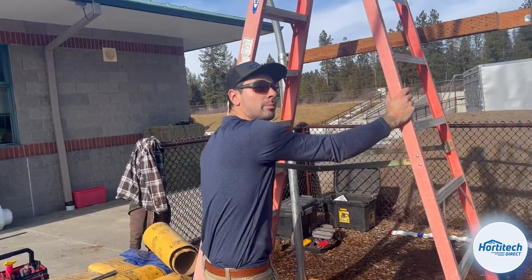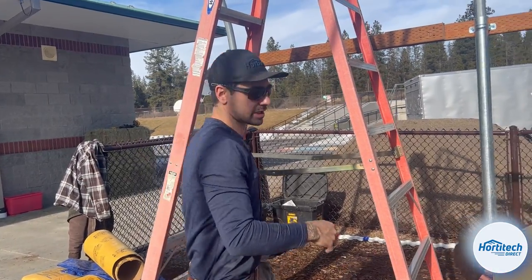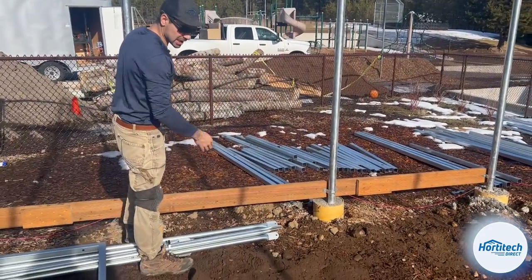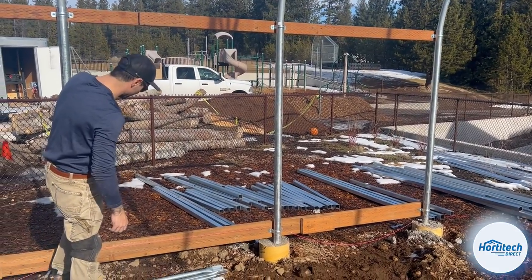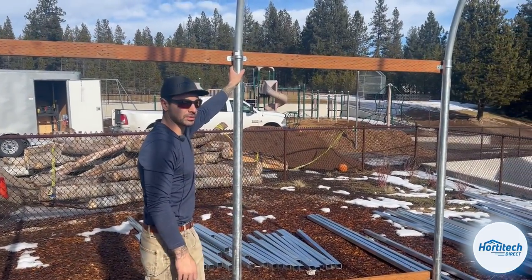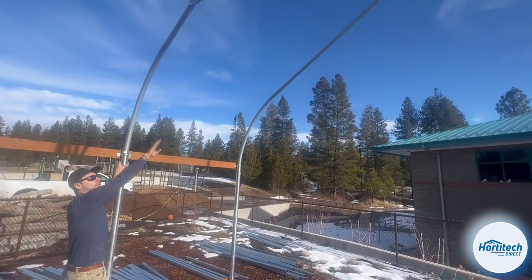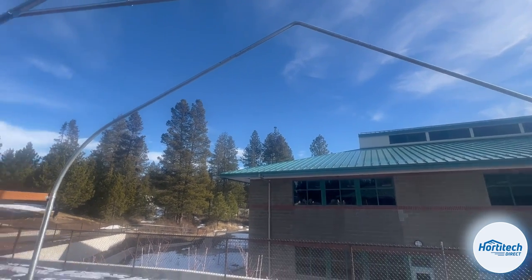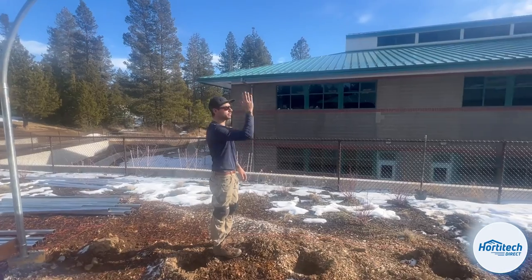Aaron's going to true up the end bows with the corner bracing, and that'll make more sense in a second, but essentially he's going to be installing a piece of metal that attaches from the base of this column. So it's the base of where the energy is supposed to go if we have face shear on the structure. So the corner brace is going to start at the base of the column. It's gonna come up, it's gonna meet below the top of the column here, and then it's gonna reconnect, and then it's gonna go diagonally up about mid-center on the end wall truss, and we're gonna be able to adjust that piece to make sure that this end wall is nice and level and plumb and straight,